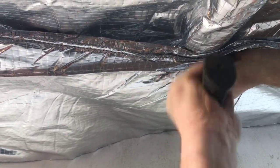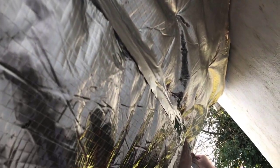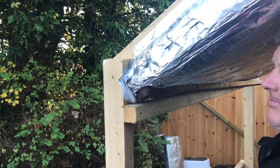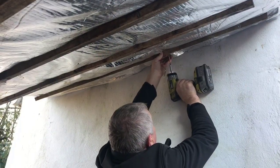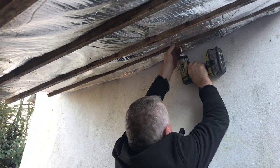The second layer can be installed using nails or a staple gun. Then proceed by taping and sealing the second layer of Superquilt again using Thermoseal foil joining tape. Minimum battens of 25mm depth are then installed ready for the plasterboard, usually spaced between 400 and 600mm centres.